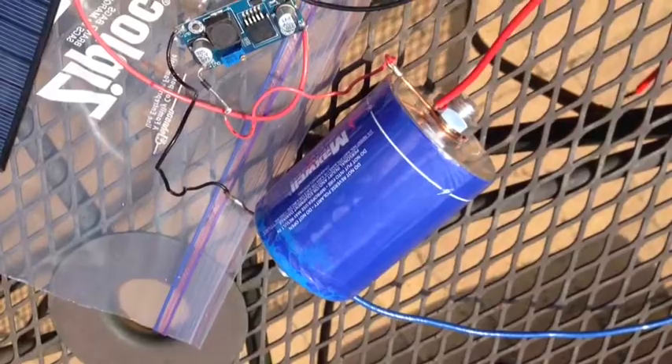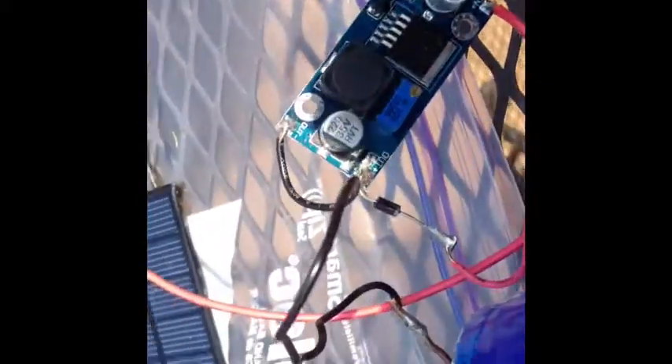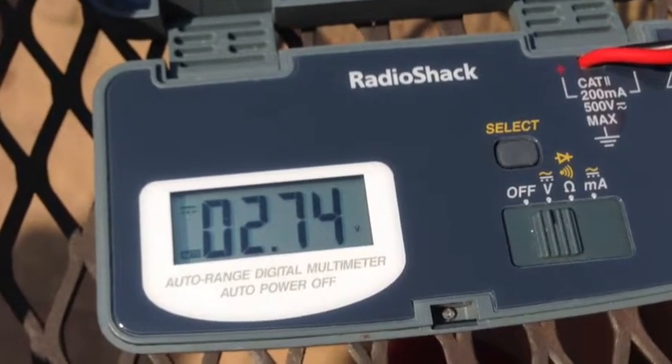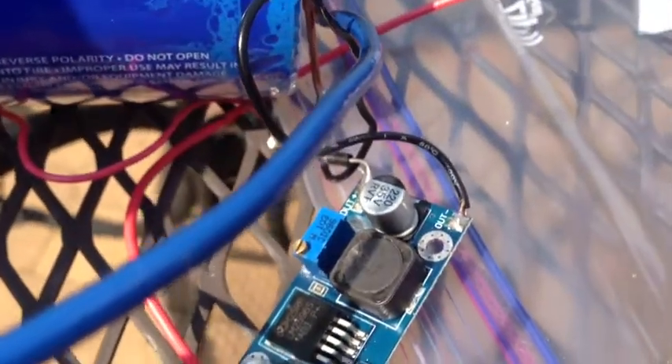After trimming the pot on the buck, I'm getting much better input into the capacitor — it's gone up to 2.6 volts. I don't really want it to go beyond 2.7 volts, so I'm going to keep a close eye on it to see if this trimming value will stabilize it at 2.6 volts. If it goes too close to 2.7, I risk damaging the capacitor. Without adjustment I'm getting 2.75 volts, so I'll come down a little bit on that trimmer so it doesn't go much above 2.7, as that will decrease the life of the capacitor.